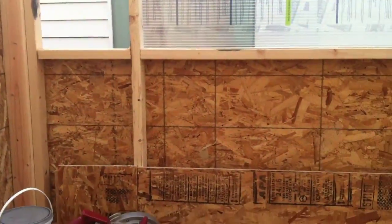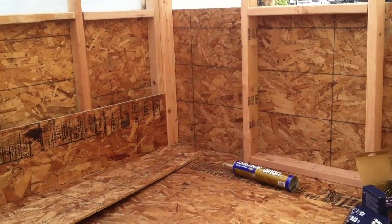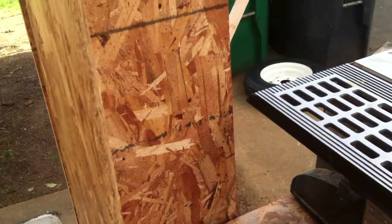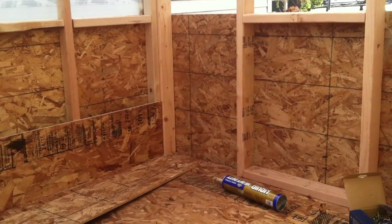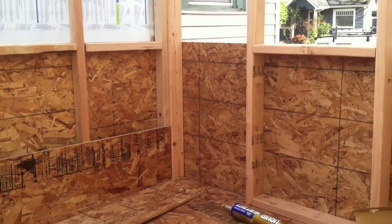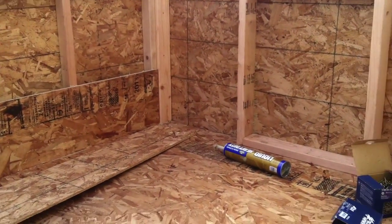The corners are compound with two two-by-fours and one two-by-three, also glued together. Any place on this where the framing interacts with the sheathing, there's glue — and the glue goes on the waffly side. Any place where framing interacts with sheathing, there's glue, and that's part of what's going to hold this thing to its shape and structural integrity as it goes down the road. Once it's in place there's also snow load and other issues to consider, but we're not going to have as much roof slope as I would like to deal with serious snow load, so there'll be some additional reinforcement shown later.